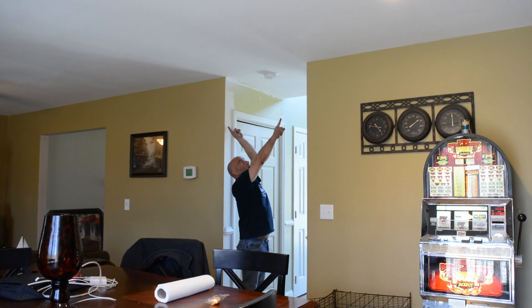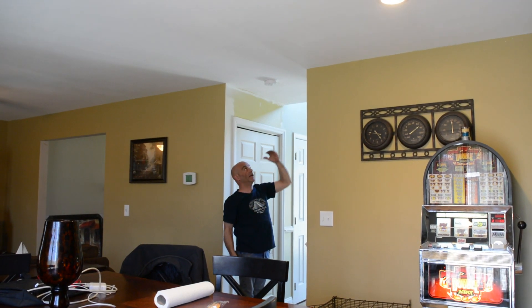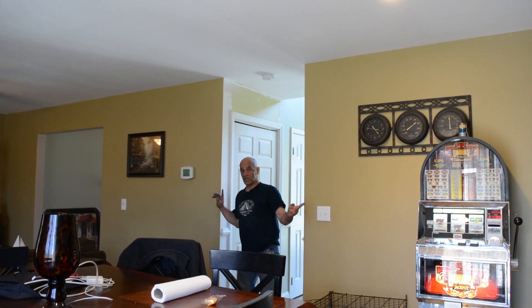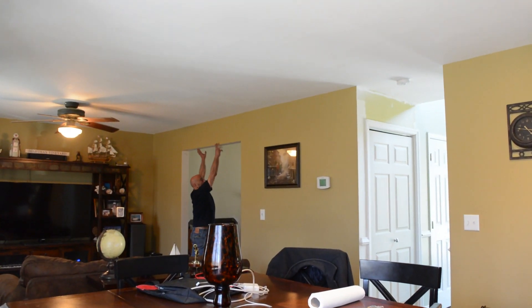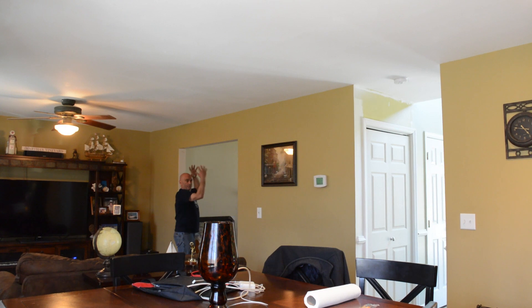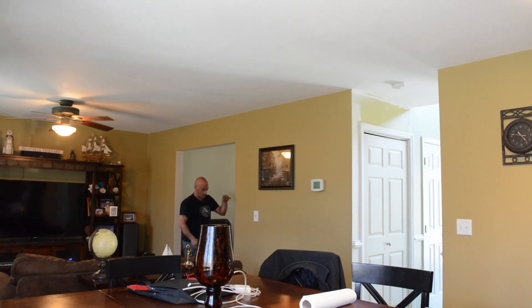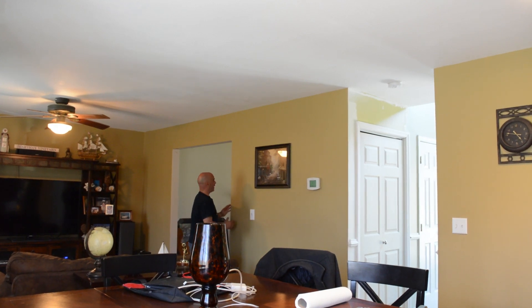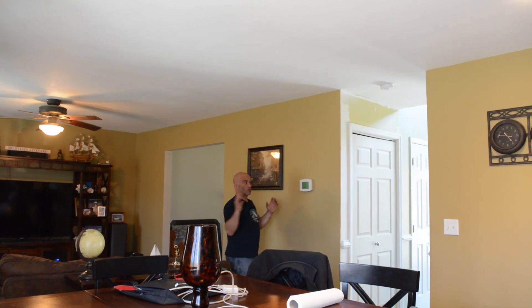Up inside here, how can it possibly be a beam up there? Well, it is — it's recessed in there and the way the ceiling joists tie into it with brackets. All load-bearing wall. Big opening, right? In here we have a header, just like that beam I showed you down in the basement. It's built up nice and beefy and it's picked up right here through jack studs going right down to the floor on top of that beam. So if I wanted to remove this portion of the wall, I'm going to have to put something in place to hold that weight up.